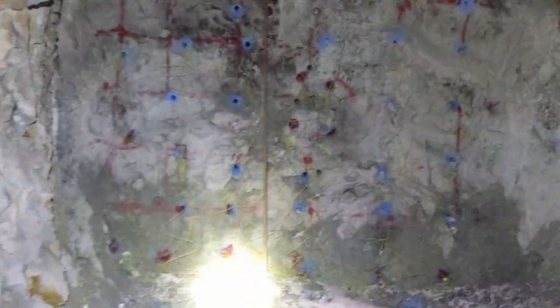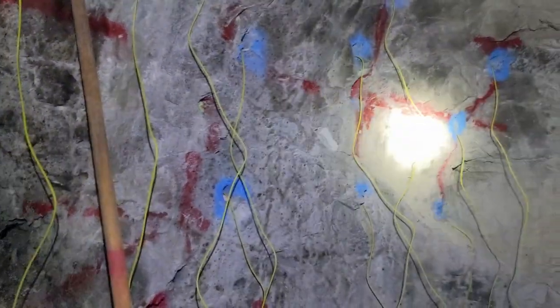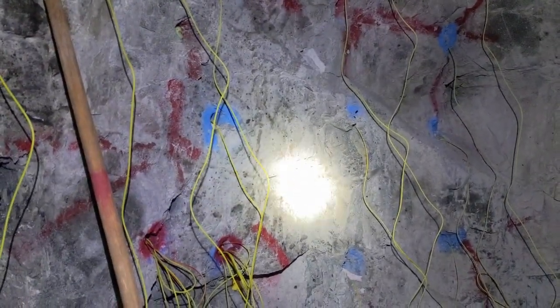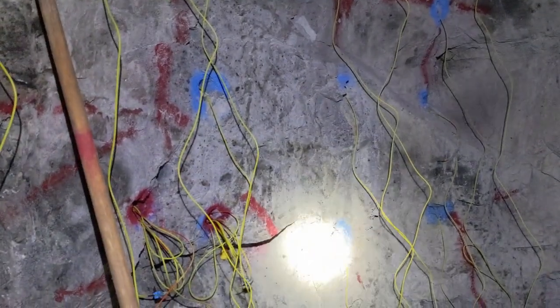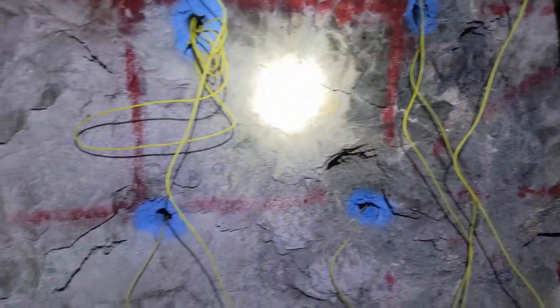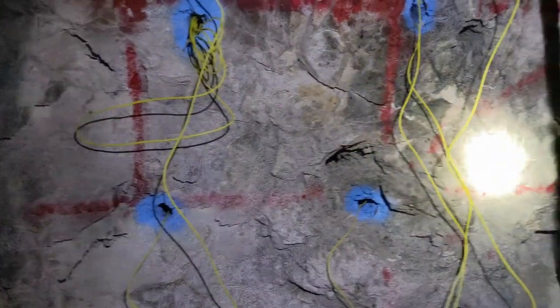I'm not sure if you could hear it over the sound of the Penberthy, but that process there, we were blowing the ANFO into the holes, which is that ammonium nitrate fuel oil prill. Each of those holes loaded with ANFO is primed with a single stick of Geldyne, good old-fashioned gelatin dynamite. So we went through 2 bags of ANFO, about 75 pounds or so, and the remaining 3 holes are going to be loaded with stick entirely.